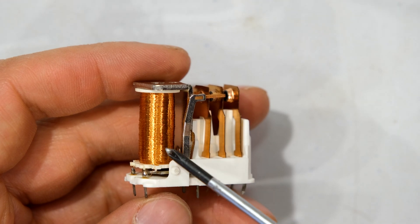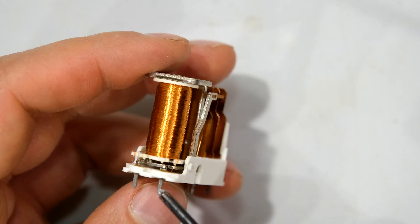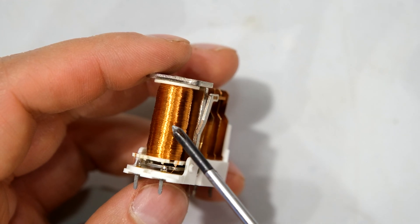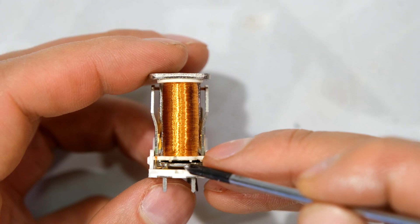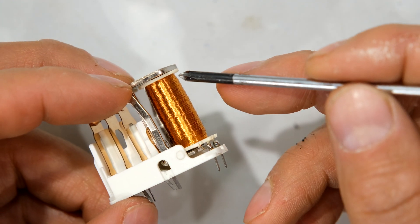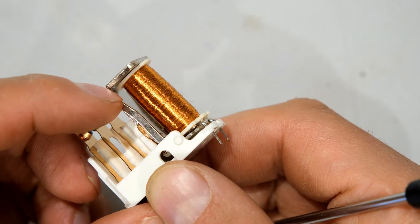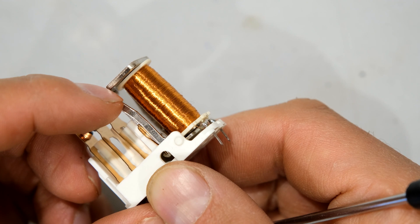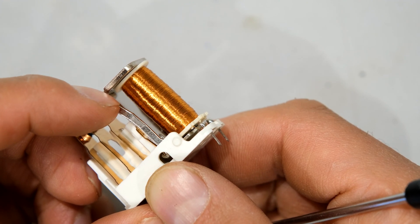On the left hand side there are many windings that go around a metallic rod. When current flows through the windings it builds up an electromagnetic field. The electromagnetic field creates a magnetic field on this rod. There's a rod that travels on the inside and at the bottom there's a platform. When we energize the relay a magnetic field is created and it attracts that platform to the rod.